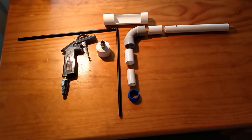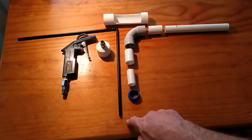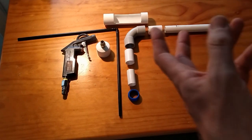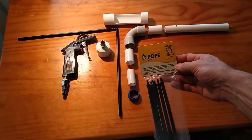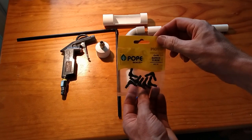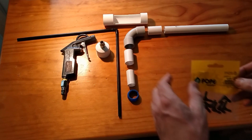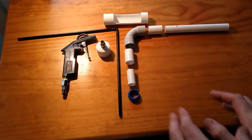What I also wanted was a rigid air inlet tube coming down into the gun, so I didn't have to use the soft tubing from the original gun. These are simply irrigation pipe risers that have sprinklers on the end. I have two of those which I'll show later in the video how to put together. The 90-degree bend is simply these 4mm barbed elbows. Now that we have all of these components, I'm going to show you how to put it together, and later in the video I have footage of how I made each of these components.